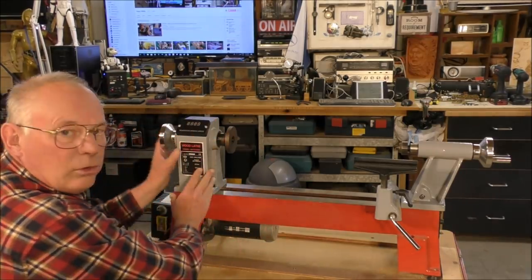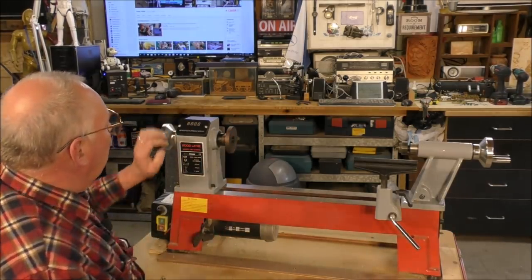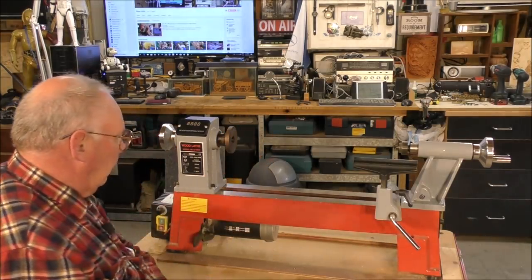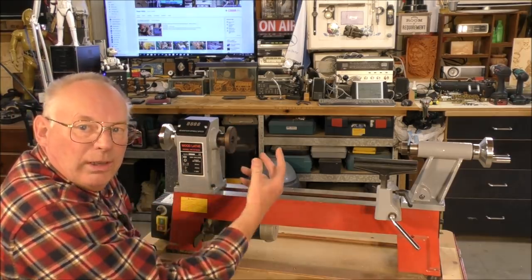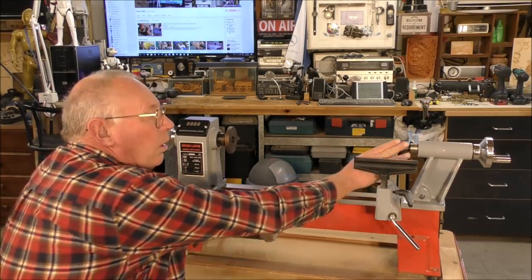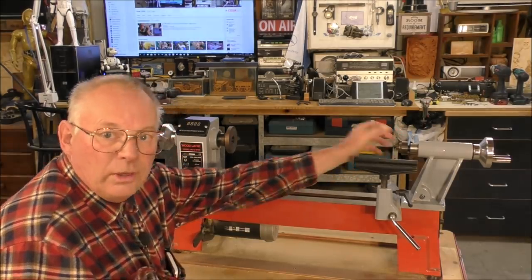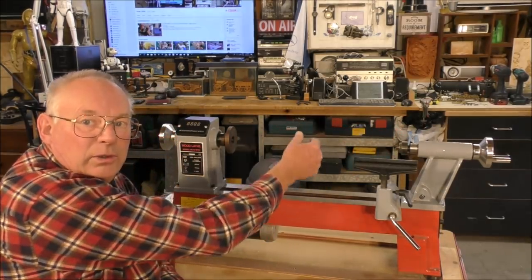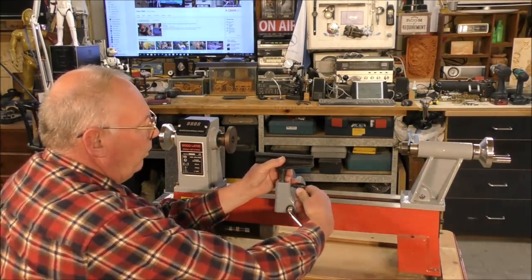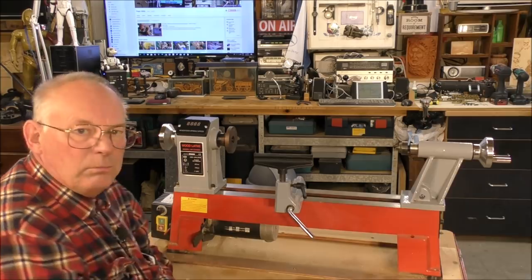So you have a headstock here with this handle here just to hold steady and to be able to screw things on, because this is on a screw thread here. This is a flange, a mounting flange. This end here is what we call a lathe center. It's got a very sharp point on it, and a bearing here, it spins. This supports the other half of the material. And this is your tool rest that is very adjustable.